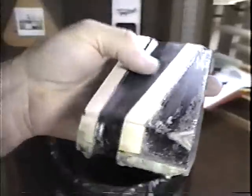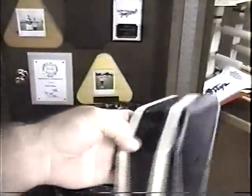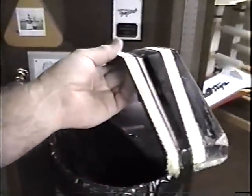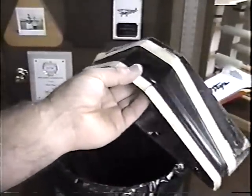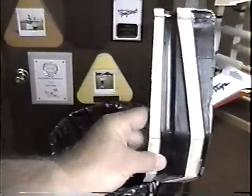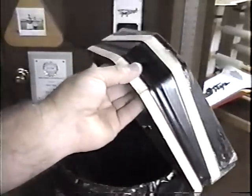Anyway, now see, by removing just enough of the material off of these edges, my next part should be 10 thousandths thinner. Maybe I can get the weights down even lower than they are right now. Anyway, reasonable parts are coming out of this mold, though. As crude as it is, laugh all you want, it's making parts.